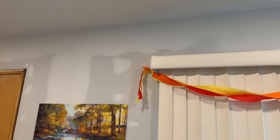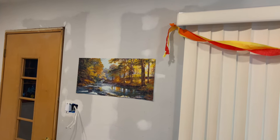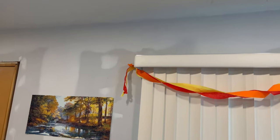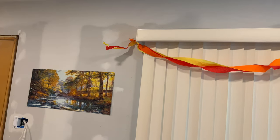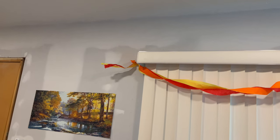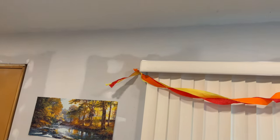Plus, along the corners, I'm also going to have to try to blend the new wall into the existing ceiling there. And obviously, I want to bring the mud out, like we've got here. From the corner down, it's about 12 inches or so. Kind of want to do the same thing with the ceiling. Bring the mud out about 12 inches. For those of you who ever think your wall is actually flat, depending on how it's done, it could potentially be flat, but a lot of times you're just taking the mud, bringing it out, and making it look like it's flat. So it's not necessarily flat, right? You're creating an illusion just by extending the distance of that mud.